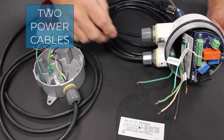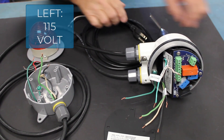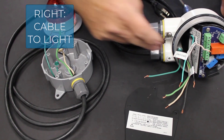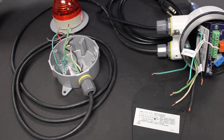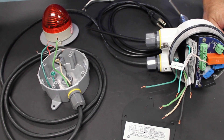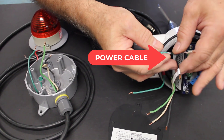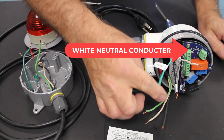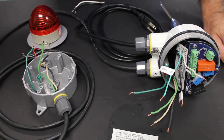I've got two power cables coming into the BMRX. The one on the left is the 115-volt power cord that's going to provide power for the system. The one on the right is the cable that goes from the BMRX over to the light — we will switch 115 volts to that light because our BMRX is a 115-volt model. The power cable has three conductors: a black hot conductor, a white neutral conductor, and a green ground conductor to ground all the exposed metal parts of the enclosure.